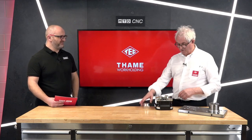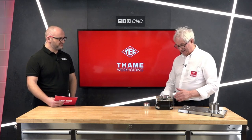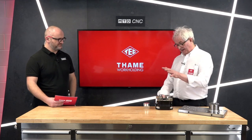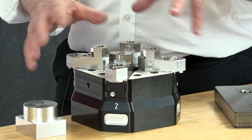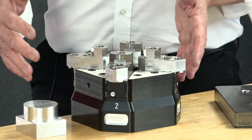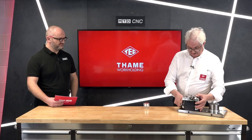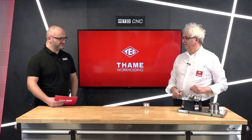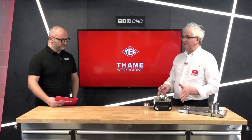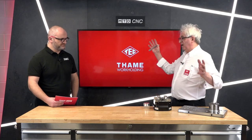The owner of the patent calls it the 'golden nugget,' and it certainly is. This is our smallest manual version for milling — it's got slot and tenon base jaws and you can move them around. We do this in a 160 size (six inch) and a 240 size, and it has studs to mount directly onto our zero point systems. The two manual versions are fantastic for milling.